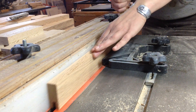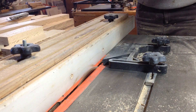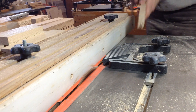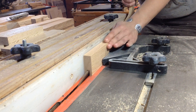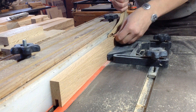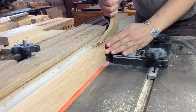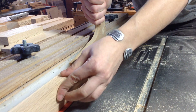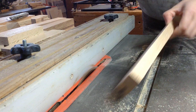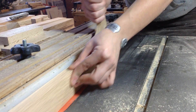That leaves a little groove in the center, and sometimes you could chisel this out depending on the thickness of it. But for this, it was thick enough — I decided to just adjust the fence and slide all these pieces through. That will remove that center flange, and then I'll have the groove in all of my pieces. After this, the stiles are actually done. I'll put those aside and then just work on putting the tongue on the rails.